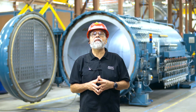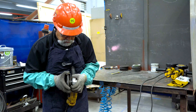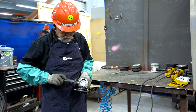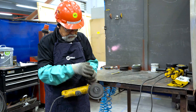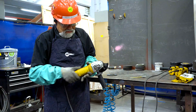There are a few things to check before plugging in your grinder. The first is that you have the right guard. Different discs require different guards, so refer to the user manual if you're not sure which one is right. After that, check and make sure that the side handle is secure so you can use the grinder with two hands. Next, check the power cord for frays, cuts, and check for damage around the housing.